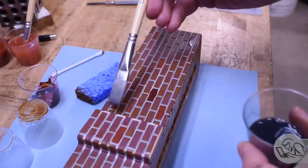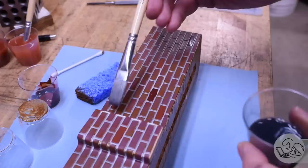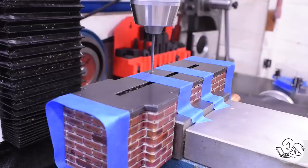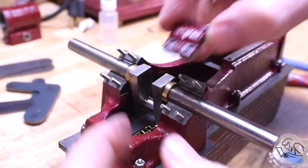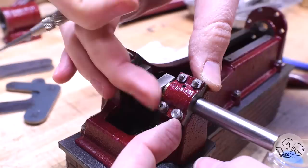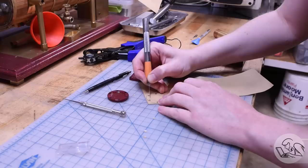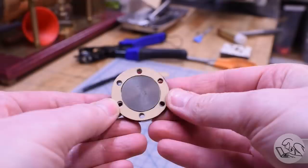I did some painting to make it look better: painted accent bricks, did a sponge treatment, and a black wash. I also made a plastic cap supposed to look like wrought iron — not that happy with it, might redo it. Studs are epoxied into the top of the base to mount the engine. Now reassembly: bearing caps go on with all the custom studs and nuts. The kit comes with paper Felpro gasket material — a little tracing and hole punching makes nice-looking gaskets.